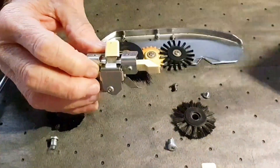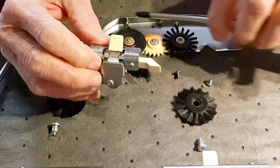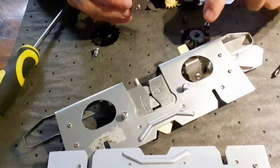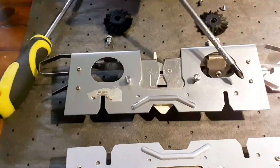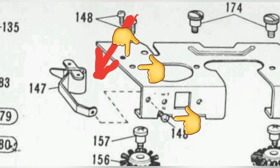This is the order in which I did this: I took the weaving brush off to get it out of the way. Then I took this wing off to give me access to the weaving brush assembly. I would suggest that for most people you take those two screws and this screw out and remove this guide section here also — this screw, this screw, and this screw on the front. These are the weaving guides and that's one of the features that does change quite a bit from model to model. This is what they look like on the 840, and here are the screws that connect them.